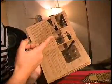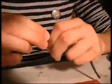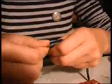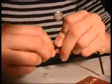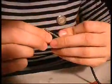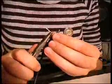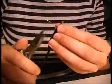That was step 2. We're now going to go to step 3, winding the coil. For this we need the piece of copper wire and our 3.5mm plug. Wind it 3 times plus a little bit extra, so it's nice and tight, and then we're going to fold the legs out. The coil now looks like this.